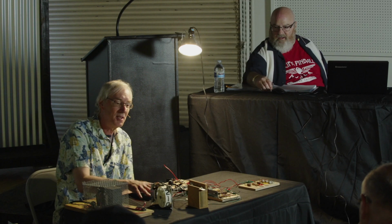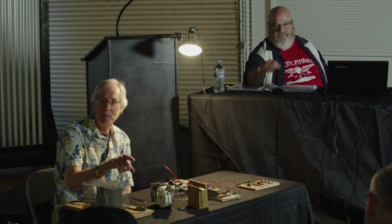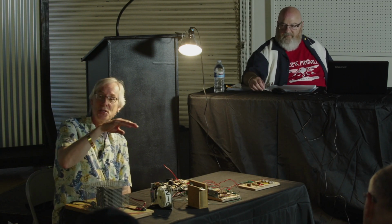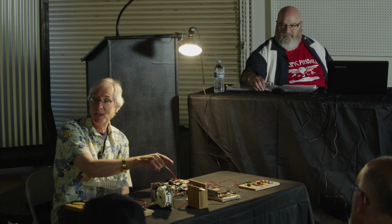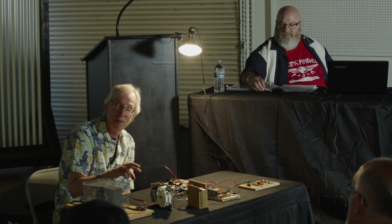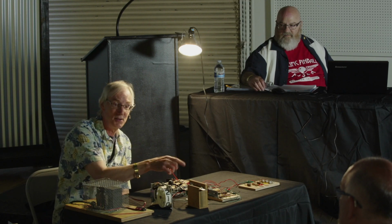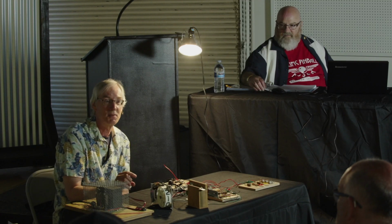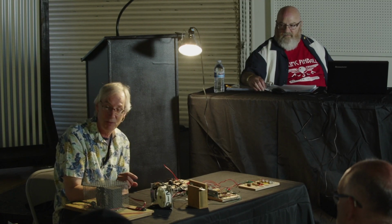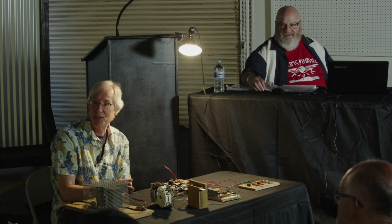However, this very same circuit is used by a pop bumper, right? And there's a relay somewhere that sends power into that pop bumper coil. So the switch under the skirt is the one that fires the relay, and the end of stroke switch is the one that says, you can let go, stop sending me power. Well, if your end of stroke switch never closes because it's not adjusted properly, what happens? You hit the skirt, the relay fires, the coil starts to pull down because it's getting power from the relay, and that end of stroke never opens up. Suddenly you're one-one-thousand, two-one-thousand, I'm overheating, three-one-thousand, four-one-thousand, I'm smoking, right? In 15 or 20 or 30 seconds, you'll have a situation, right?